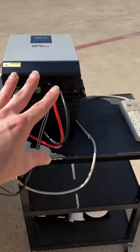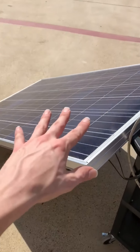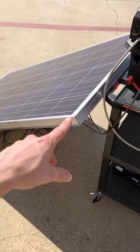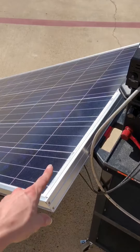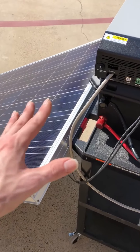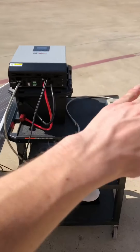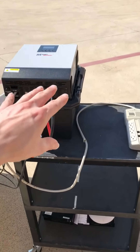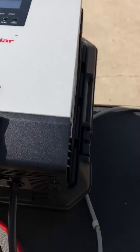You can plug in up to 800 watts worth of panels here. This panel is pointed at the sun and we're getting 200 watts. You're never going to get that perfect 230, even with a brand new panel — you would in perfect conditions. But you could do up to 800 watts, so if you've got all your panels flat mounted somewhere, you might still be able to get your 500 watts into your battery.